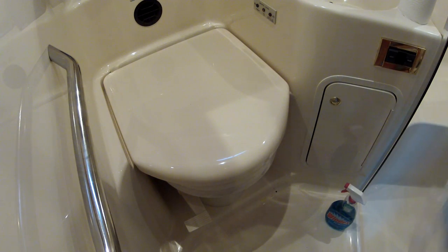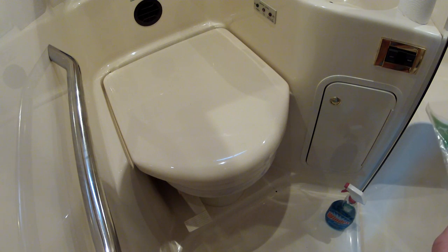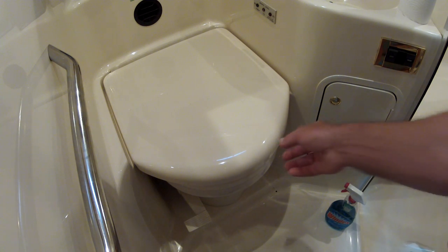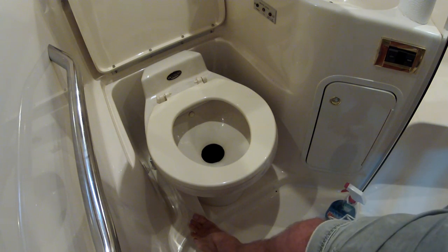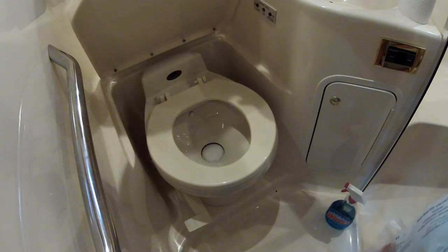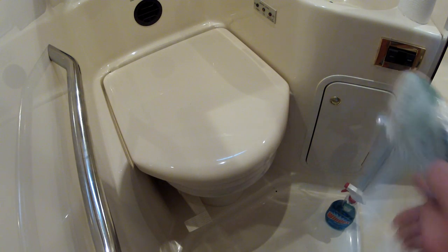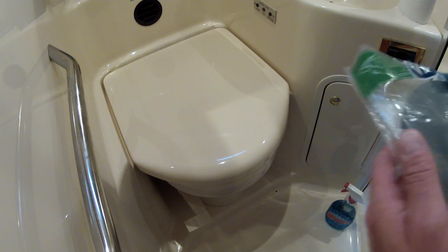Okay, what I did on my summer vacation. This is one of our two vacuum flush toilets we have on the boat. It sounds a little echoey because I'm in the head, in the washroom. The issue we've had over the last couple days is that the vacuum pump for the vacuum flush toilet keeps coming on all by itself and the bowl is draining away. What has happened is the seal is gone in that toilet, so I'm going to replace that. It's a real simple procedure — I've actually done it once a couple years ago. I don't know why this thing is already gone; I guess it dries out.